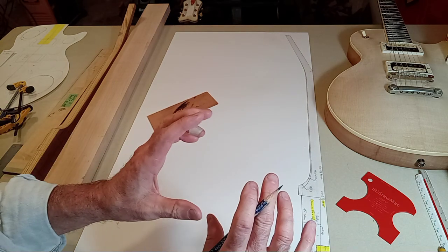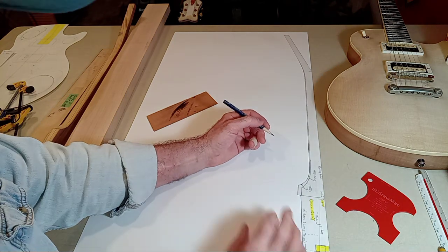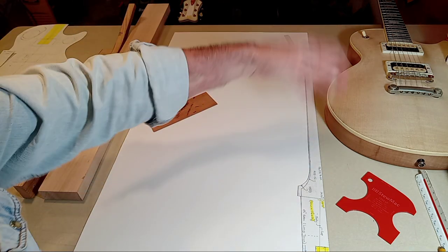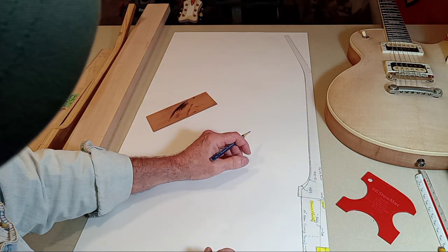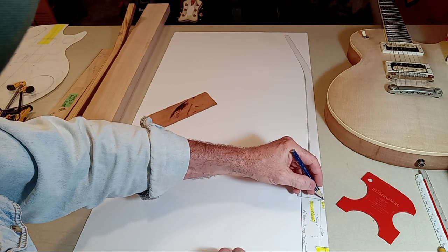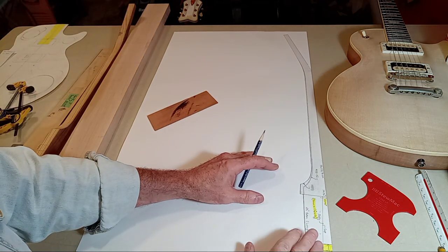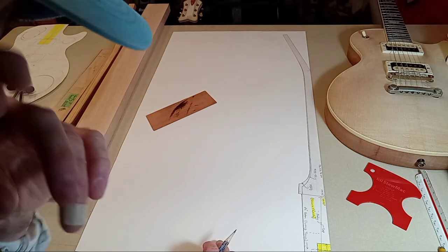I'm just trying to clarify: if you can do it on paper, then you'll start seeing how to rough it out and ways you can guarantee certain things. You'll also make note of things like, 'I can just leave that long because it doesn't matter — I'll cut that once it's on the body.' Don't think it to death. For the most part, there are only three or four constants that are critical: from the beginning of the fretboard to that 16th fret location, whether it's a 24 and five-eighths inch scale or a 25 and a half inch scale — a considerable difference between those two scales.